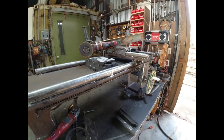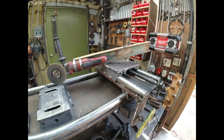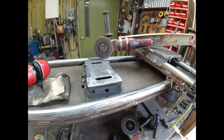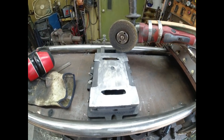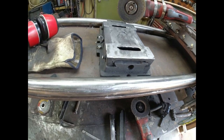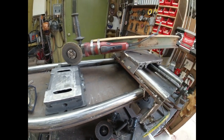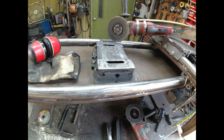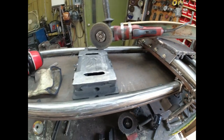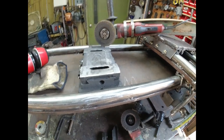We'll have to get it a little smoother than that so I can clamp a heavy steel plate on top. So my grind-o-matic is a little too limber to get a perfect finish. It kind of has some flex in it, but I got a good flat finish. And then I hit it with the file, and it showed that the high spots are pretty random. I don't have one corner high or anything. So I'm calling this successful. I can unbolt it from here and find a plate to put under it and over it, and then I still have the problem of accessing the swivel bolt.